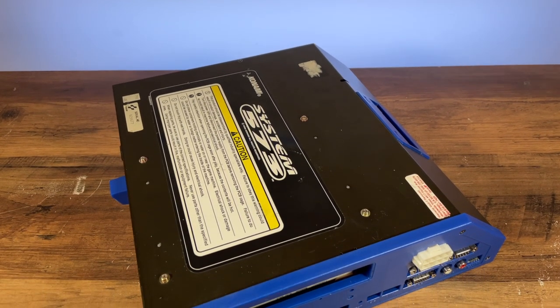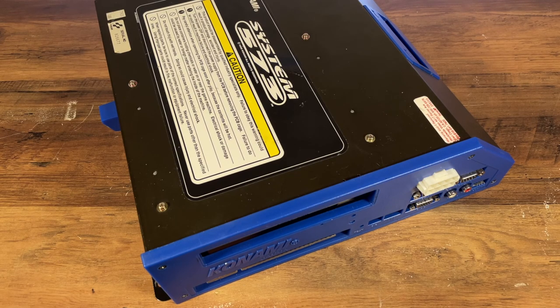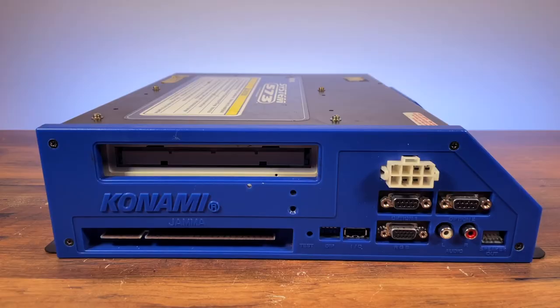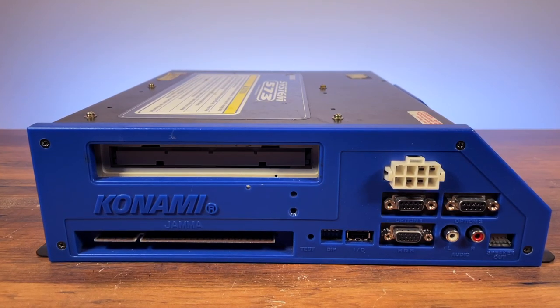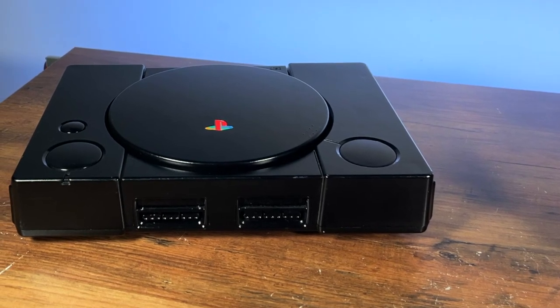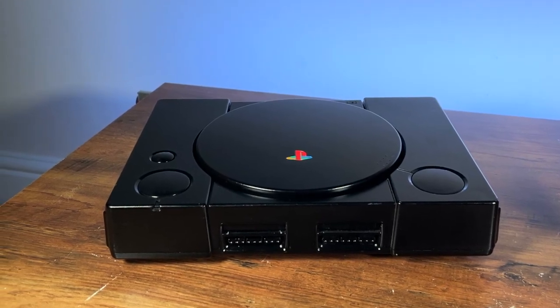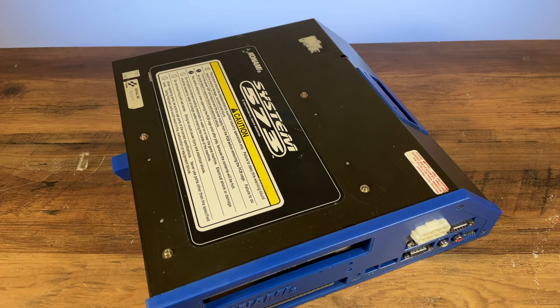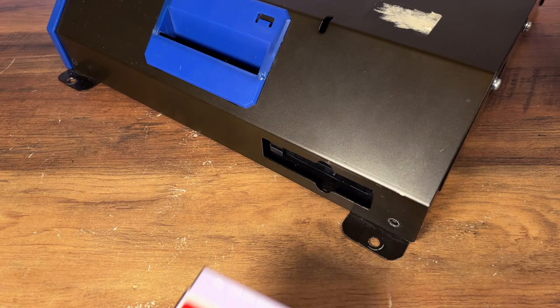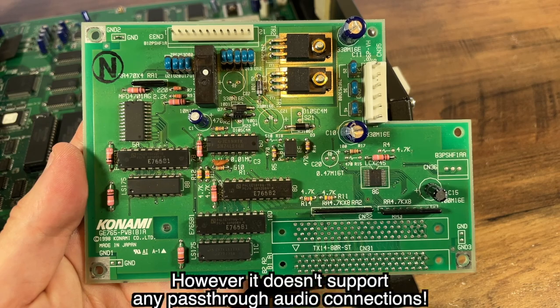Already you might be seeing just how affordable and versatile this system really was. From the outside it really does seem like a Swiss army knife of an arcade board. The JAMMA and JVS ports allow it to be used in existing cabinets covering both old and new designs, and being based on the very popular PlayStation 1 made it easy to develop games for using the same toolsets developers were already familiar with, adding little extra development cost. The use of CDs and security carts also made distribution very cheap, and expanding the base hardware was easy via either the PCMCIA expansion port or the internal IO expansion.